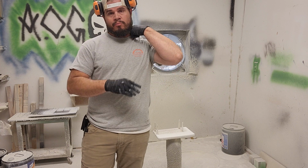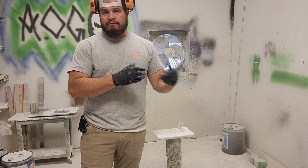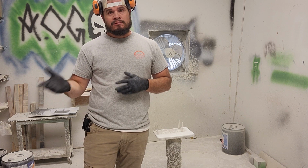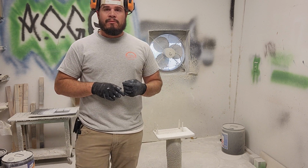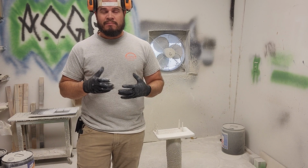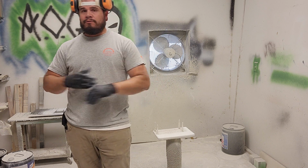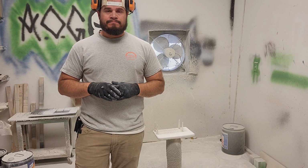your final product. When you bring your parts in here, normally they're blown off before we get them in. I blow them off again once we get them in. So I've blown them off two times, to make sure there's no residue left on them from our wood filler. Sawdust will stick to it, especially when the conditions are like they are today in South Georgia. It's a little bit humid, so our sawdust is going to have a little bit of moisture in it, and it's going to try to stick to everything that we're doing. It might even be a little static electricity, so who knows, but that's what we deal with in South Georgia, and we just learned to deal with it. You wipe it off, blow it off, sweep it off, whatever you want to do. Just make sure that your product is clean before you go to put primer on it.